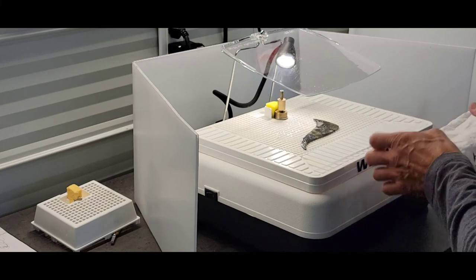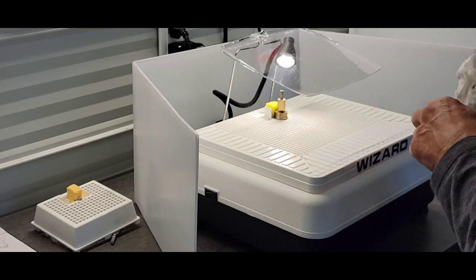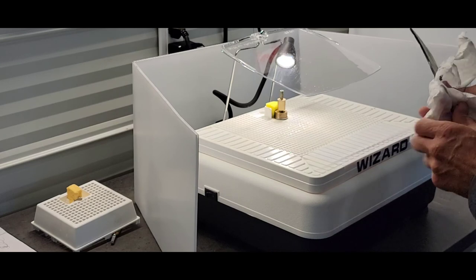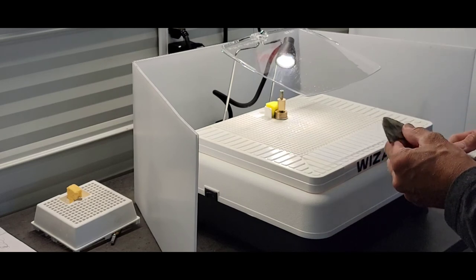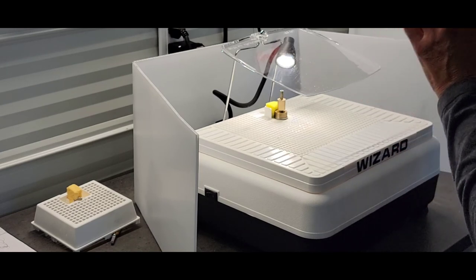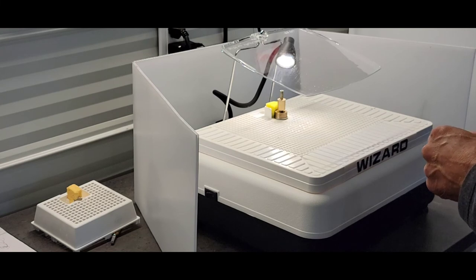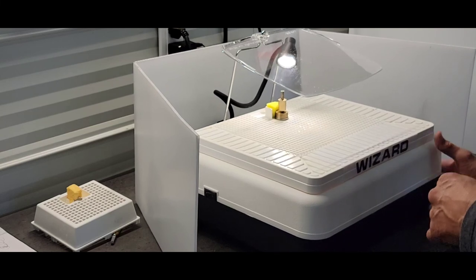Each piece is going to grind slightly different. Some is softer, some is harder. You can get different courses of bits. This is a standard bit that comes with it, and sometimes the harder bits, until they wear in, will kind of chip the glass edge a little bit, so you may want to go to a finer bit, but that's something you can add afterwards.